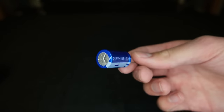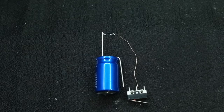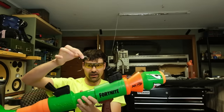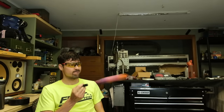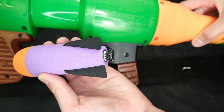The capacitor is the battery, and it powers a small heating element, which is used to ignite some flash cotton. To activate, all that's needed is a switch to go between one of the contacts and the heating element. Then it's just a matter of some routing, a little heat shrink, and presto! The capacitor is charged by connecting the main contacts with a power supply set to the voltage printed on the outside. And this capacitor has 15 times the capacity of the original Nerf dart launcher, meaning it can do multiple launches before recharging. This design is so mind-blowing because it takes us all the way from a giant launcher with no trigger to literally just a trigger.